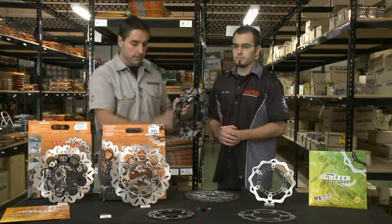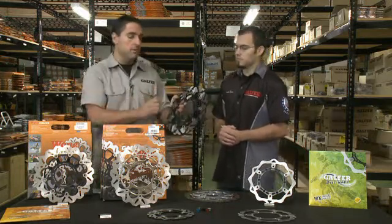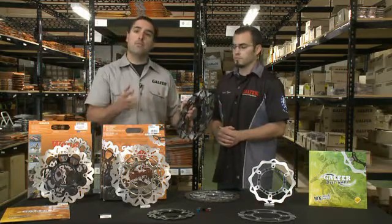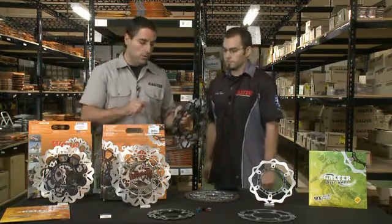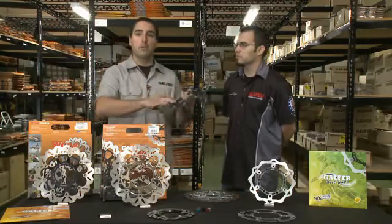In some instances like this one, the AMA one, it's different. But in general, the Superbike design delivers the exact same performance as the street rotor would, but at a much shortened distance and with a lot more aggressiveness. The brake torque generated on this blade versus this one is completely different. Always with the exact same process: laser cut, double disc ground, heat treated. But again, different designs providing a different type of feel.